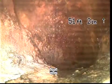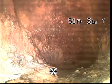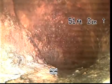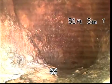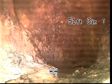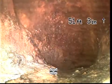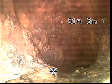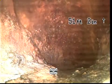If it's a street that's not much traffic, sometimes they just get a crew in and dig them all out. If there's a heavy traffic area, they want to be less invasive, and they will liner. Or depending how deep it is, the deeper it is, that means a wider hole, wider trench, more backfill, more asphalt, more compaction. So they just get to play it either which way.